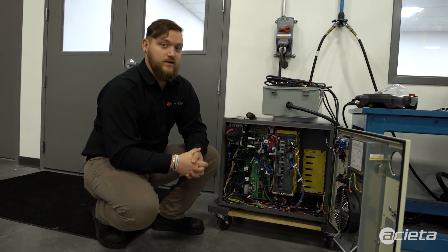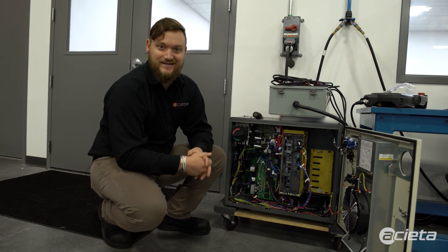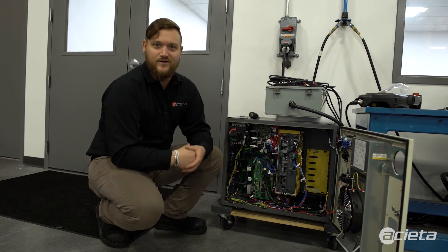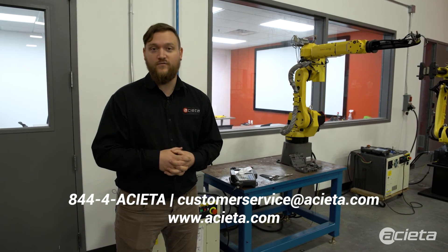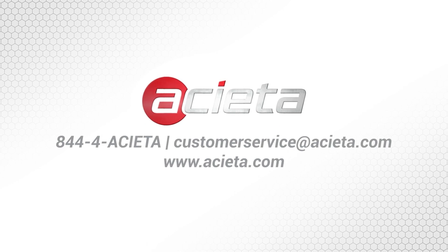You have about 30 minutes to change this battery, so be sure that your robot has been powered on for a while, as you don't want to lose any of the contents on your robot. If you do, links in the description below to perform an image restore will be in there as well. Once you have finished replacing the RAM battery, go ahead and close the door. That concludes greasing, oiling, and replacing the batteries in your M10 and M20 robot. If you have any further questions, reach out to us at aceta.com or by phone at 844-4ACETA.